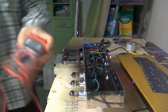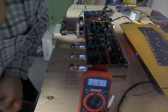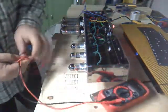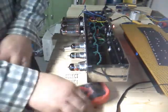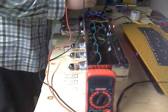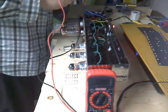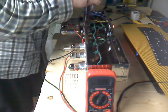For this one, the primary secondaries are supposed to read a certain value. Let me angle this so you can see it — that should be reading all zeros right now for AC power. Going from ground to one of the mains, it looks like it says about 360, and this is supposed to be about 720 across both sides without the center tap.